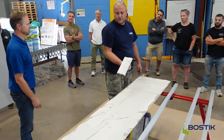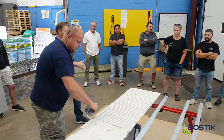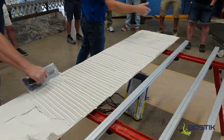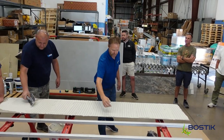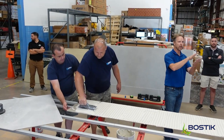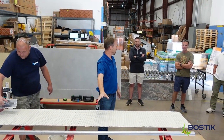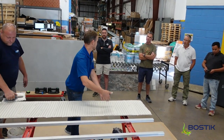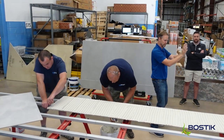See that he's doing directional troweling. Very few haven't been doing this. If the panel is longer and wider, you'd go from the middle out. This is not a rainbow pattern back and forth — straight troweling. When you start seeing spots with starts and stops, you don't want air trapped. As you beat the panel in, it's pressing into another combed-out layer on the wall. You don't want spots where air can stop. Work the shortest distance of the panel. As you beat it in, start from the middle and work your way out consistently down the panel to get perfect coverage.